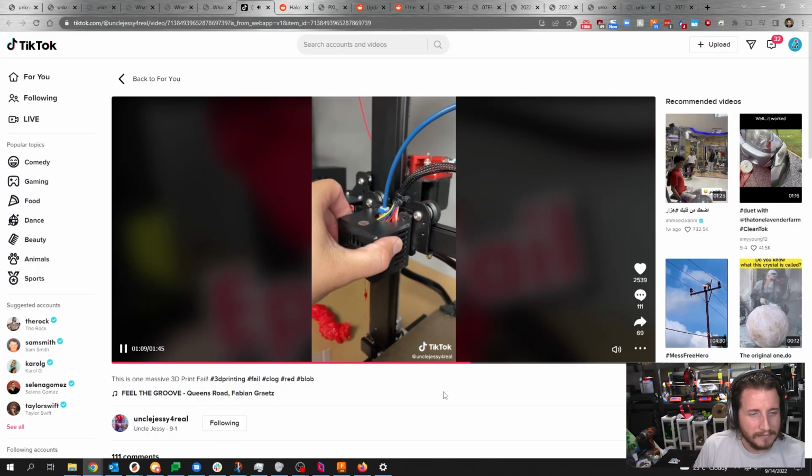Be careful to use metal instruments around your hot end. Not because of the thermal conductivity, but because of the electrical conductivity. It is best to use a pair of tweezers or even a pair of pliers that are ceramic in that they won't transfer electricity. So if you do, for some reason, touch both wires on your heater or short your heater, nothing will happen with a pair of ceramic pliers versus a pair of metal pliers where you might kill your motherboard. But yeah, he's been doing it for long enough. I have faith.